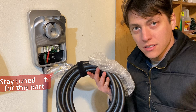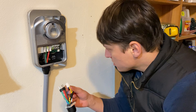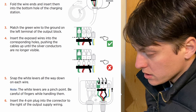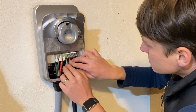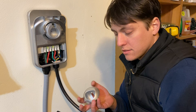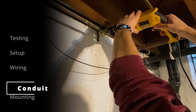Here is the cord as it comes in the box for the ChargePoint Home Flex. This is the part that goes into the EVSE. Here are our leads. On the electric vehicle supply cable, the ground is actually the left one, and their diagrams indicate having the red one in the middle and the black one to the right. Get our cable clip here. The last part is popping in the holster for this particular style of plug. Now we have a holster.